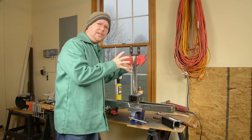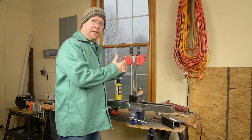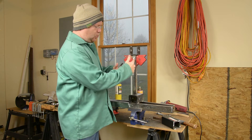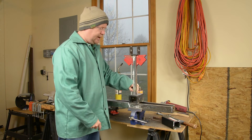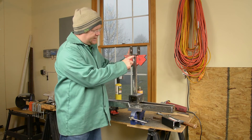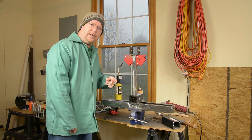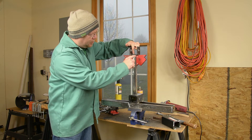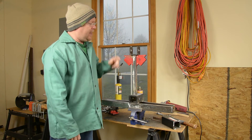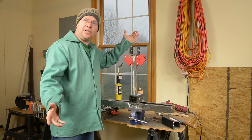The top bracket is going to be a whole lot simpler because everything is one-eighth inch steel, and the welder is going to have a much better time with that than with the quarter-inch down here. I have the magnets in place to make sure this thing is square to the vertical post. I'll tack it front and back and then get the magnets out of the way so they don't mess up my arc. The minor challenge is that these welds are more horizontal than flat, so I'll need to get the torch in there and drive the heat upward — but that's okay, that's the direction heat wants to go anyway.